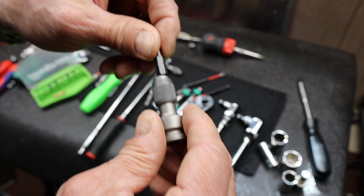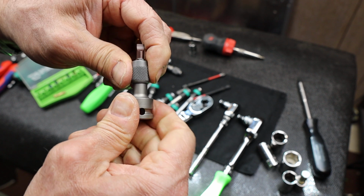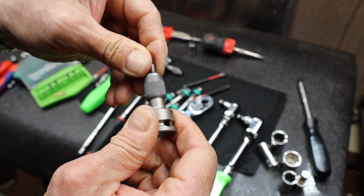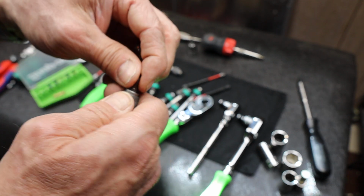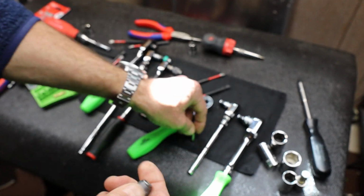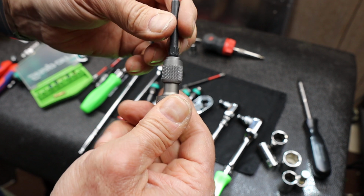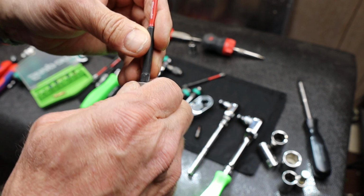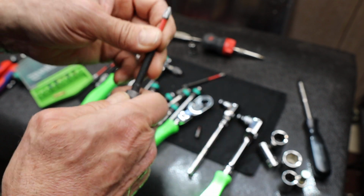These, on the other hand, require the collar to be raised in order to get the bit in, and then they seat, like that little snap right there. Once they're in, they're rock solid, and they're holding on 2 sides, or 2 corners, into those little notches in the bit. If you throw a speed bit in, what you end up doing is dropping the bearings into that large recessed area in the bit, which means that there's a lot of play.